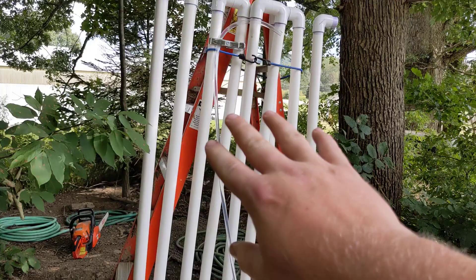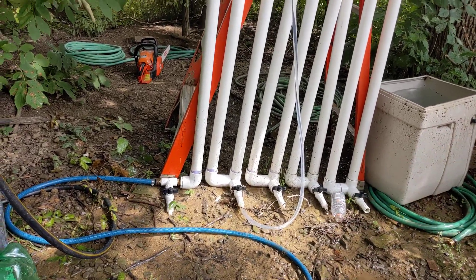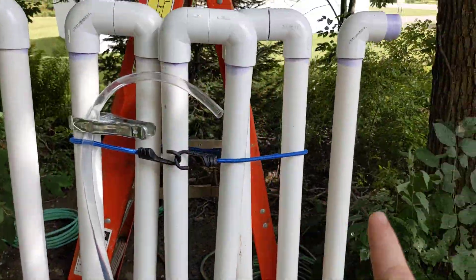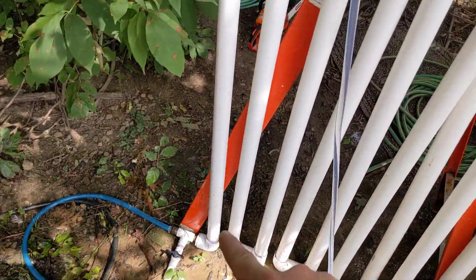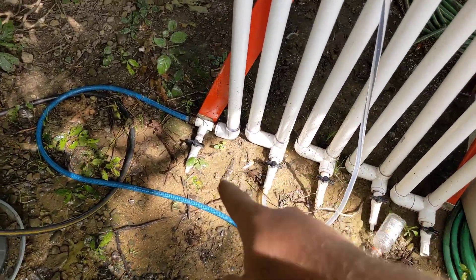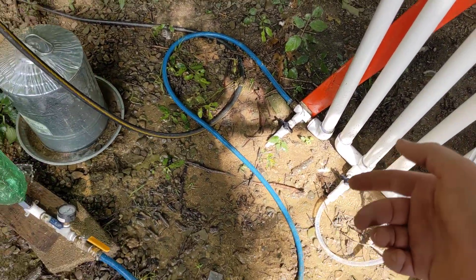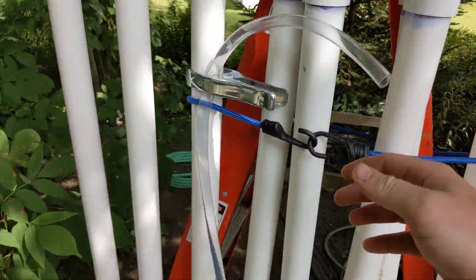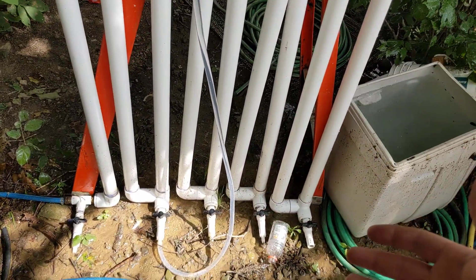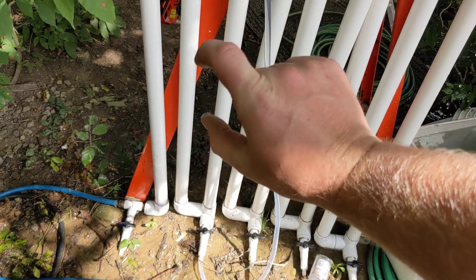This is my back-pressure simulator. The way it's designed, water coming out of the pump goes in and has to create a column of water, then trickles down, creating another column, and so on. At the bottom of each column I can tap off at different head resistances and delivery heights to get a flow rate. It works for lower flow rates and delivery heights up to about 20 feet, since there's 25 feet here, but adding more compresses the air inside so the effective back pressure becomes less as you scale it up.